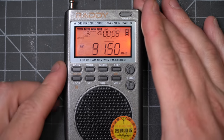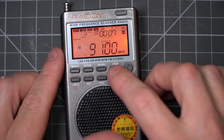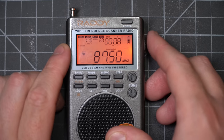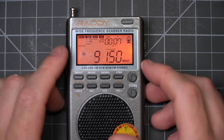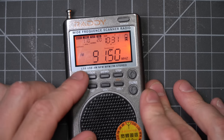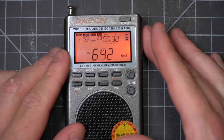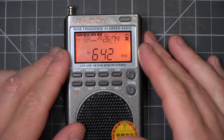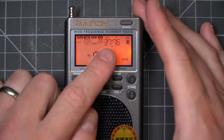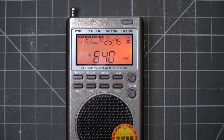To navigate bands, you scroll the side dial or use the up/down buttons. You can change the step rate by clicking the little button and the arrow jumps through options. Next band is AM broadcast. You can see the dB jump rate and SNR signal-to-noise ratio — watch it go off frequency a little bit, it drops right down, and when you're right on top of the station, it comes right back in.